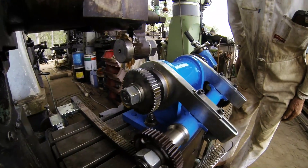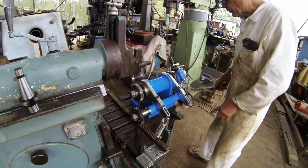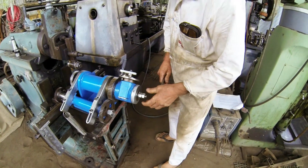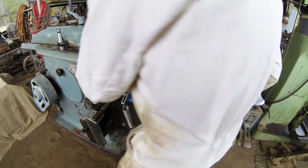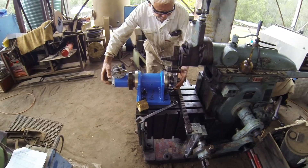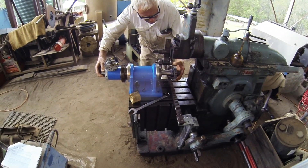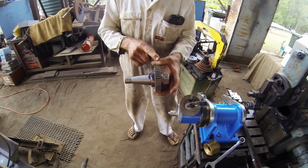What I might do is take that out and show you how the gear is held on the arbor. I've got a drawbar here that comes right through the middle. Knock that out. The gear is held on an International 40 taper.